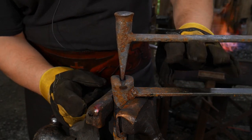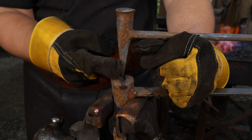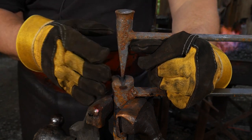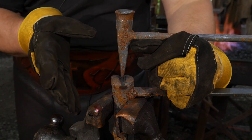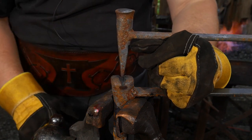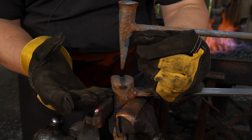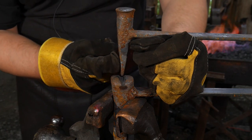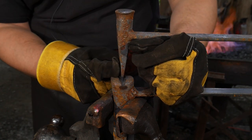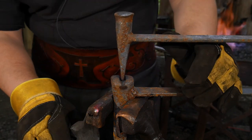All this is is a spring fuller or a spring swedge — I have a fuller on top and a swedge underneath. This can be done literally in a wooden block with a top tool. Take a simple bar, say a quarter inch by one bit of mild steel, grind a radius on one end, and use that as a fuller working over a wood block. Hammer on one end and let the radius end do the work underneath. It doesn't have to be elaborate or made from high carbon tool steel. If you're interested in making a tool like this, I do have an entire tool making series on the channel — linked down in the description below.